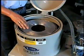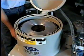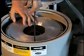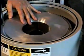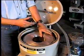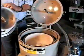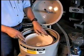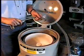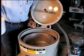Now that we've opened the enclosure lid, the next thing to do would be to remove the actual lid of the bowl. It's held in place by four socket head cap screws. We'll unscrew those with the supplied hex key, loosening them going across from each other. Now that we've removed the four screws that hold the lid in place, we'll now remove the lid. The solids would be contained in this liner right here. To remove the liner, we simply use the liner lifting tool, which is supplied with the machine — it drops in and clips onto the liner. The liner is easily removed so you can dispose of the solids.